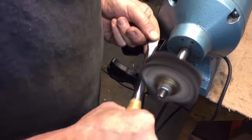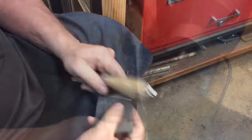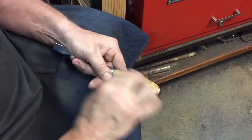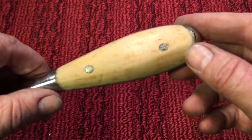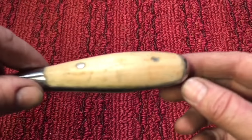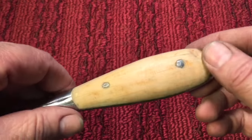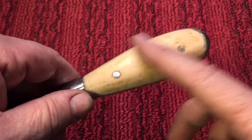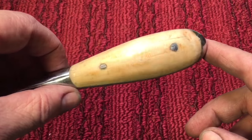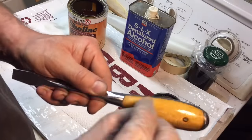We buffed the blade out to make sure that was all done before we started sanding the wood down. We did it by hand and went with the grain. We used a razor blade to scrape off a lot of this — whatever they did, they dumped it into varnish or shellac — but it was really in there. It took about 35 minutes to sand it down to get it to this point. Now we're going to wipe it down with denatured alcohol and put on some amber shellac. There's no real difference between amber and clear shellac, except amber shellac has a little tone to it.